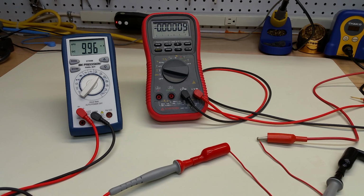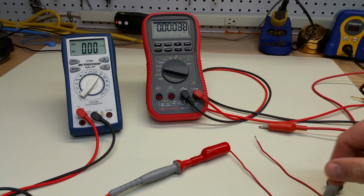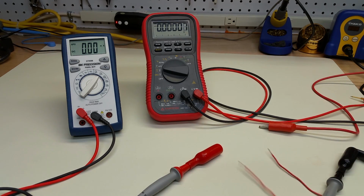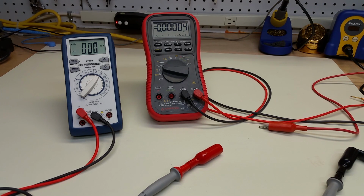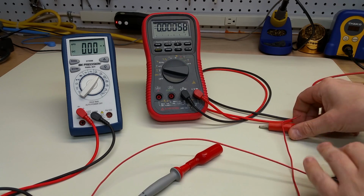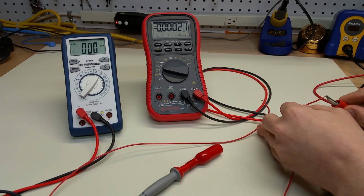But again, we've wired this up on the bench, and the question is, well, can we really believe that? Why believe that versus what I measured directly with the amp-probe meter to begin with? Well, we can at least see if the measurement gives the right trend by cutting a piece of wire from the same spool, but twice the length, and measuring the resistance of that. So here's such a wire, and we'll just proceed to hook it up here.